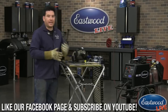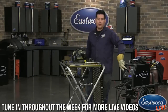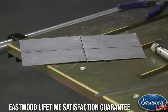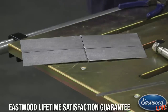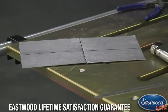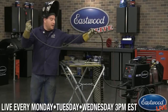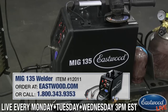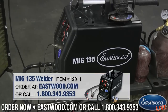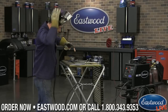I'm using 20 gauge steel here — this is from our patch panel kit. If you're looking for sheet metal, we offer a patch panel kit that comes with a couple of different sizes of aluminized steel, really great for making repairs in sheet metal. I'm using the MIG 135 that I already have set up — the 135 is just a 110 welder that works very well for doing sheet metal work up to medium fabrication. I'm going to tack these real quick and then we'll show you the difference.